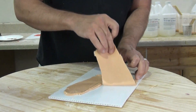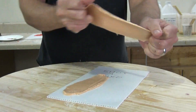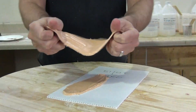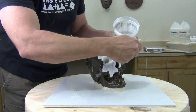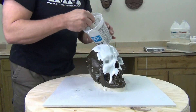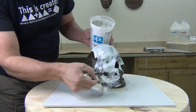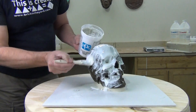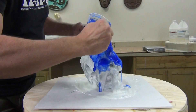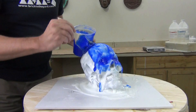Cannot stress this enough — always make sure the additives you're using are compatible with the silicone you're working with. We've just introduced a lot of new silicone formulas, and one thing I found is there are some formulas out there with different base resins where they might thicken with some silicone thickeners, but then it might compromise the tear strength. Always check the product description on our website and make sure everything you're using is going to be compatible.